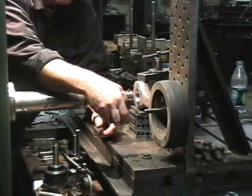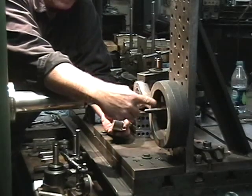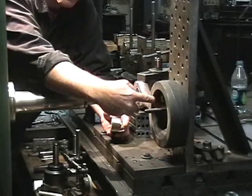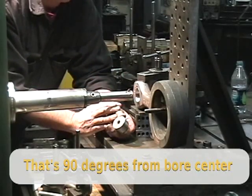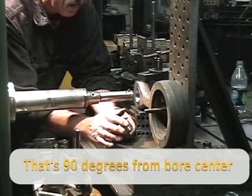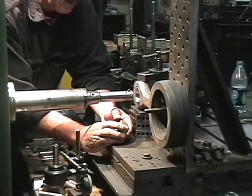This is for a shaker screen bearing. If you set them at a 90 degree angle inside that bore, a round bore is going to come back pretty much zero from now to eternity when you hang it over the buttons. They act like an inside-out V-block.